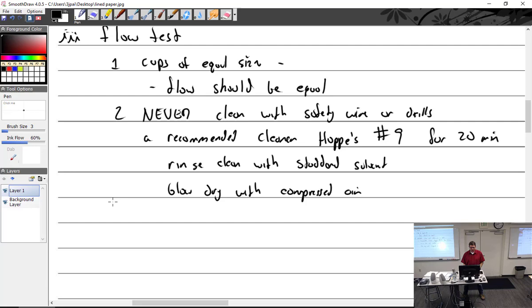Do not over torque. You will break things. Maybe I never mentioned this, but the wrench size is not the bolt size. And I'm noticing, not to pick on anybody, but you guys still are having problems reading torque charts. You can't make up something, like magneto's drive member is the gear on the drive shaft. It is not the thing that holds it to the engine.